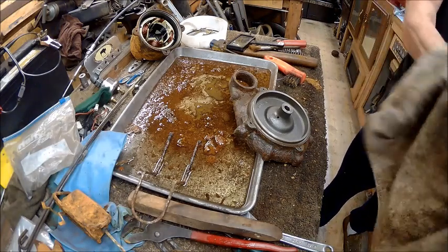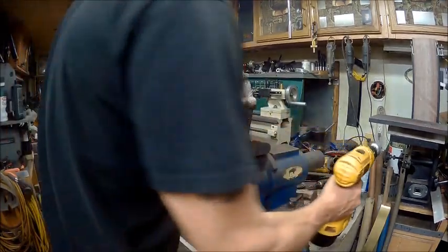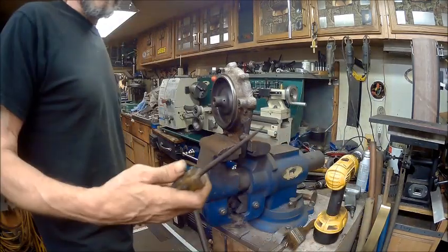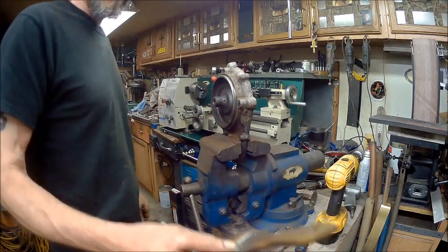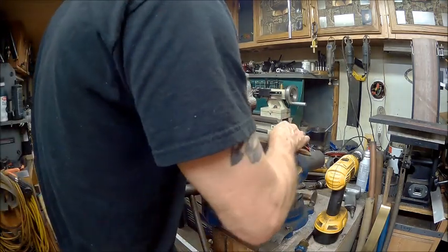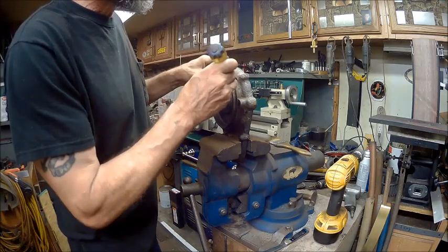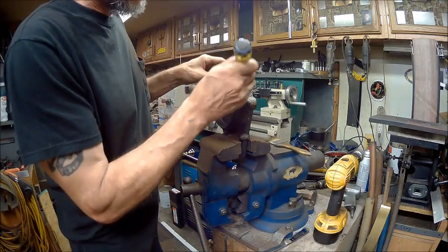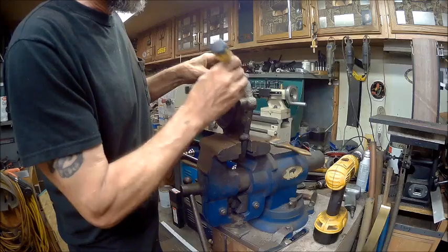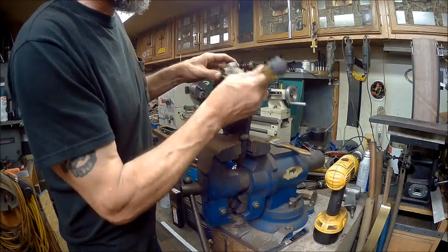So I guess we'll meet you at the vise. All right guys, what we've got is a drill with a wire wheel on it, a poker with a point, a brush, and a pocket knife. Basically we're just going through and making sure this thing is smooth by getting rid of as much of that rust as we possibly can. There's a whole bunch of it right here, so we just want to get that down as close as we can by just picking at it — because it's just flaky rust. You've got to poke all that off of there.